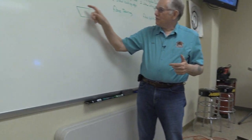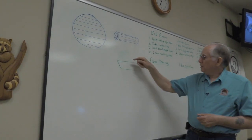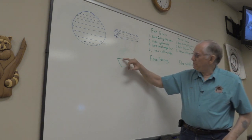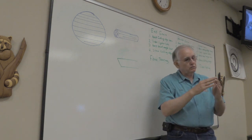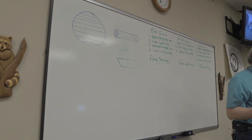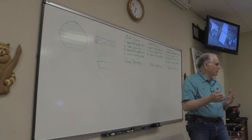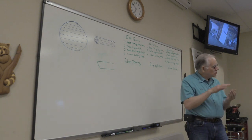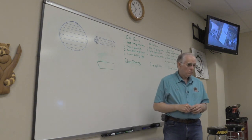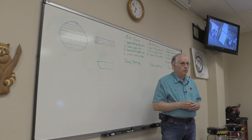What is sharp? When you have two planes meeting at a line that is zero width — that's sharp. In a perfect world both of those surfaces would be mirror smooth, but you're not going to get mirror smooth off any of these grinders. There are going to be grinding marks on both surfaces, so when those two surfaces meet it's not a nice smooth plane — it'll have jagged edges. Those jagged points are brittle and they'll break off, making your tool dull quicker. The finer the wheel you use, the smaller those scratches are, giving you a finer cutting edge. That's why many people hone — they use a diamond hone to hone those surfaces after sharpening to get rid of some of those scratches.